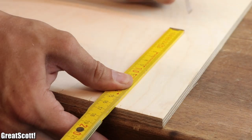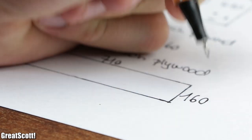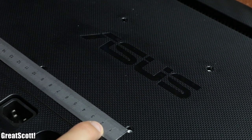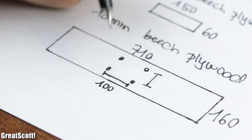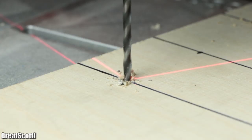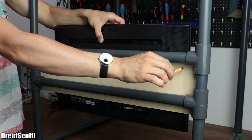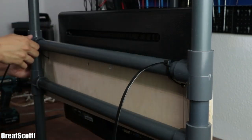Last but not least for the mechanical work, I marked a 71 by 16 centimeter square onto the 10-millimeter thick piece of beech plywood and cut it out with the circular saw. After marking its center point, I measured out the placement of the mounting holes of the monitor that I got from Amazon for this project. As soon as I was sure that they all featured a distance of 10 centimeters to one another, I marked them around the center of the wood and created them with a 4-millimeter drill. After securing the monitor to the wood and lifting this construction into place, I marked four more additional holes to properly secure the monitor to the overhead camera rig with zip ties.